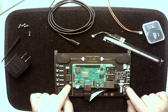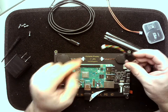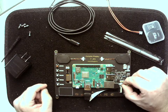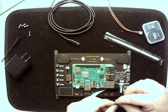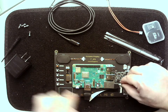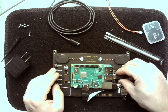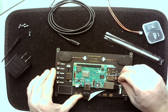Now we are ready to give power to the touchscreen. To do that we're gonna take this little piece here and connect it to the area that says 5V plus touch. These do only go in one way so make sure they are lined up nicely — they should just slide right in once oriented the right direction. And then these get plugged into one of the USB ports like so.